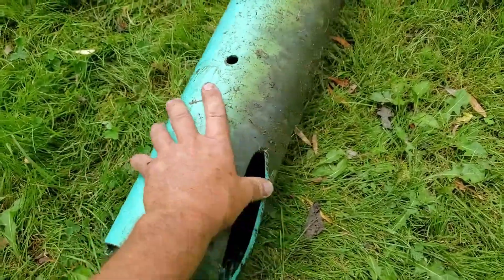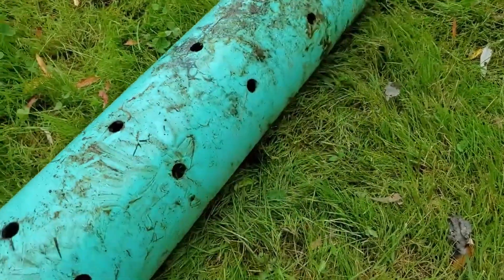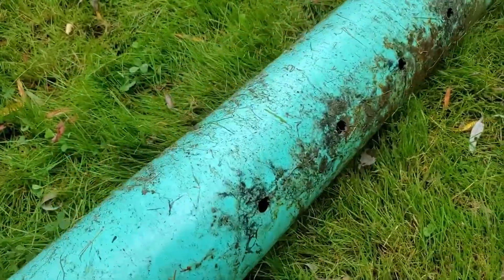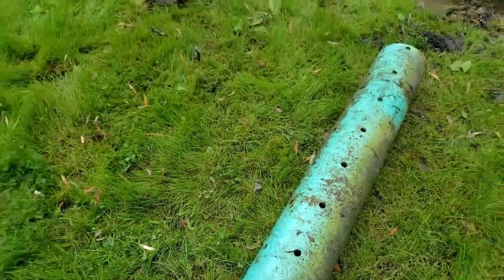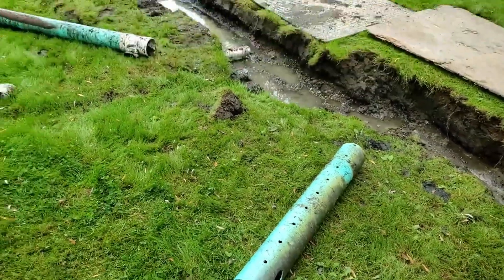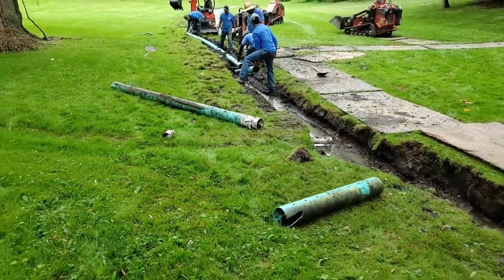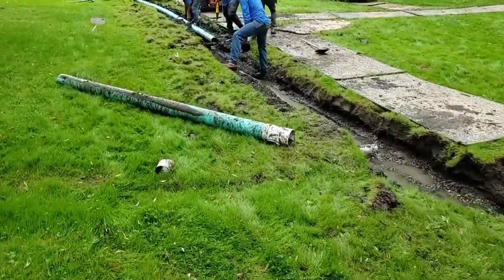As we talk about all the time — see how there's no holes? Only on the bottom. Corrugated pipe has holes 360 degrees all the way around, so it's always going to flow water. On those really hard rains, those torrential rains, those thunderstorms, it'll literally flush out any sediment.